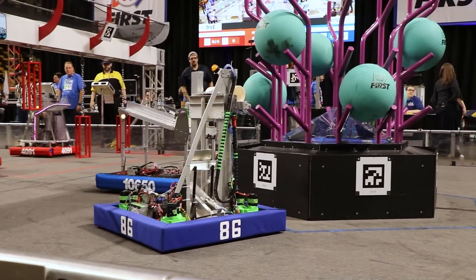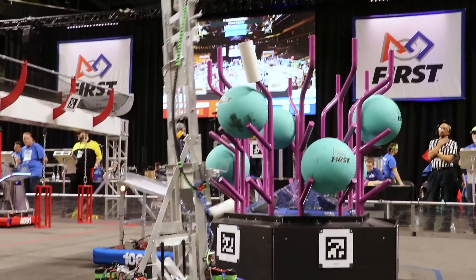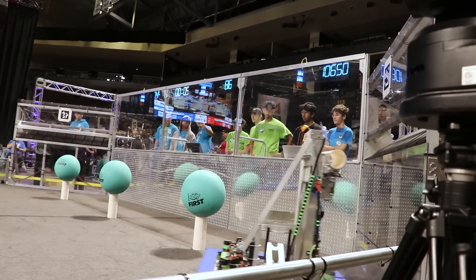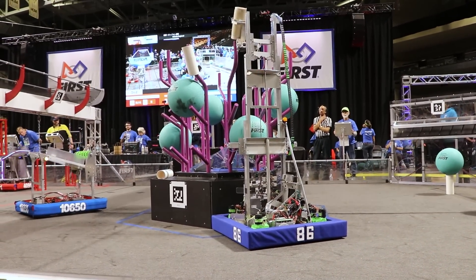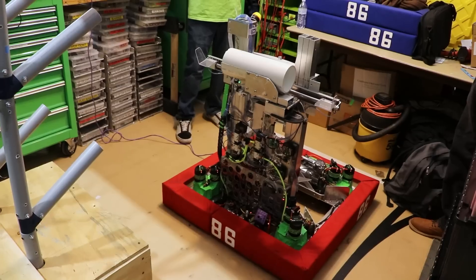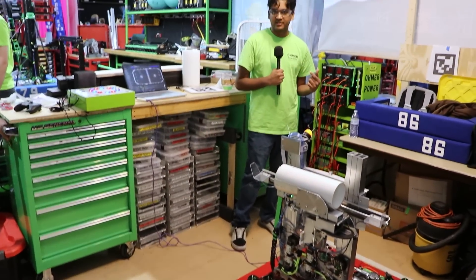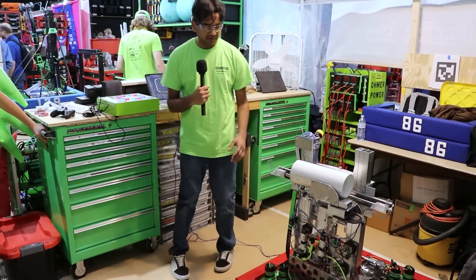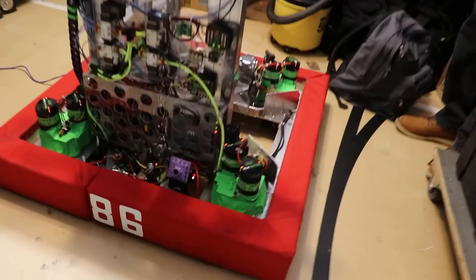Arjun, you wanted to go over some more stuff? One of the most important aspects of our robot was automation. As you saw Victor aligning to the AprilTag and trying to score coral, he did it all with a single press of a button — just holding down the trigger and it did the entire sequence. To accomplish that we had to use five RealSense cameras scattered across the entire robot, essentially giving a 360-degree field of view. There's one right here and then four on the swerve steering motors of each module.